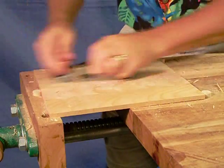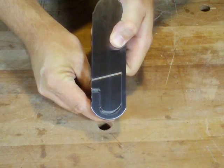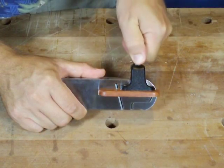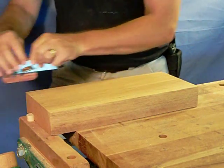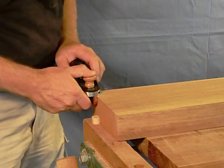The plane has good weight and the skewed blade reduces effort when planing boards flat and smooth. It also features a throat opening that is adjustable for aggressive or fine work. The rabbeting fence adjusts quickly and easily with the collet style locking knob. This plane excels at cutting rabbets quickly and smoothly cutting along the grain. A scoring wheel can be easily deployed for cross grain rabbets.